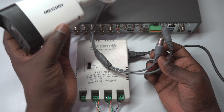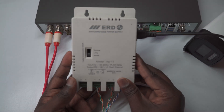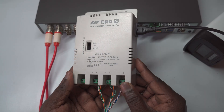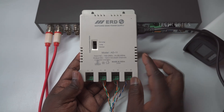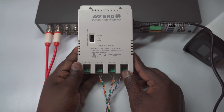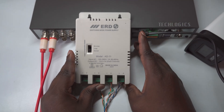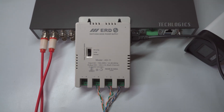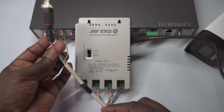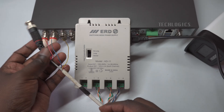Let's start with the wiring. Please use the recommended type of SMPS shown above for these CCTV cameras. For information on the BNC video connector, you may refer to other videos that explain CCTV BNC connections. In this video we will specifically focus on connecting the camera to the SMPS using a standard 3+1 CCTV cable, which includes three wires for power and an additional wire for microphone connectivity, separate from the video cable.